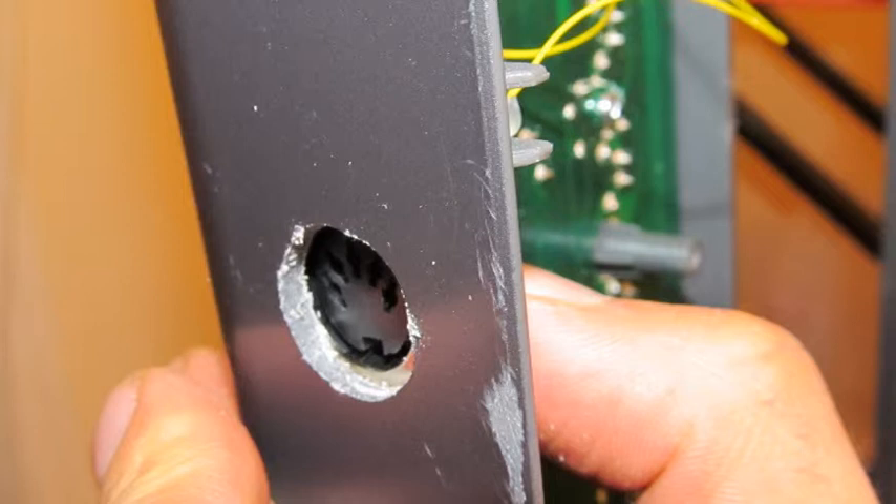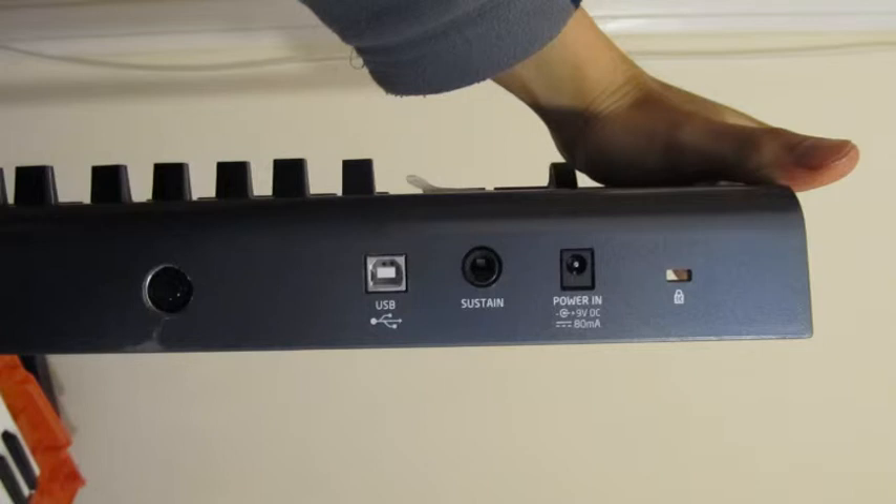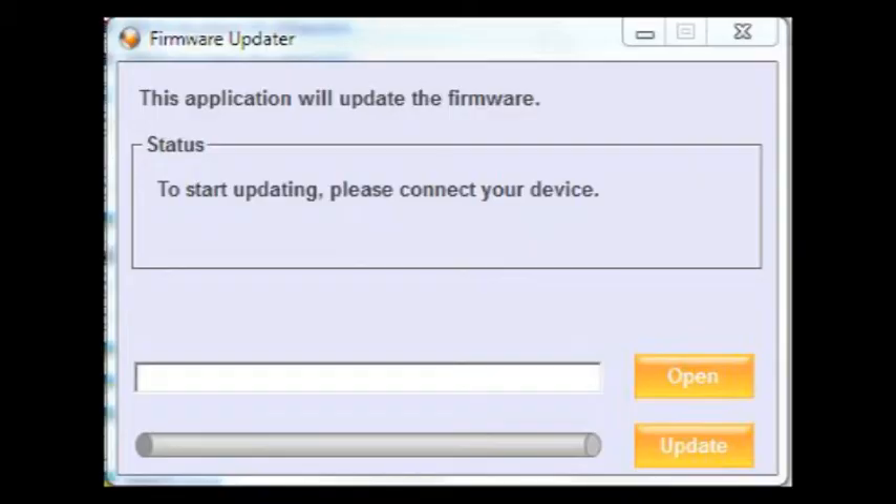I used the glue gun to fix the MIDI DIN port. Step 4: you may use screws or whatever you have on hand. The mounting needs to be strong enough to withstand plugging in and out a MIDI DIN cable, as sometimes it can be quite stiff and require a bit of force. Step 5: screw the unit back together and make sure all the ribbon cables are fitted. Step 6: update the firmware and use a version which has the MIDI output activated. You can find these in the link below. Make sure that you use the correct version of firmware on your device.